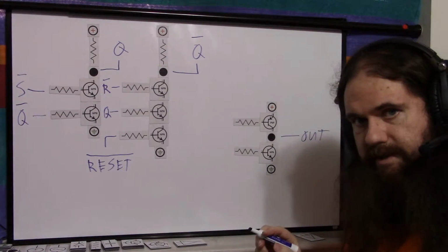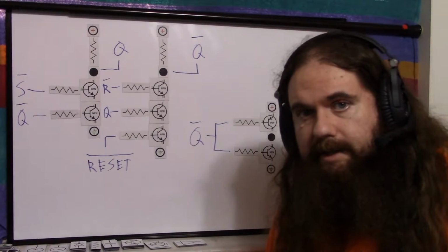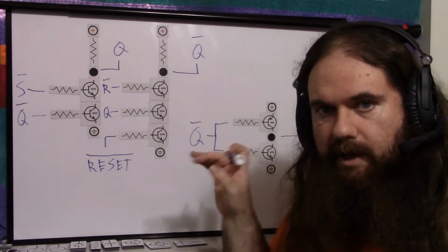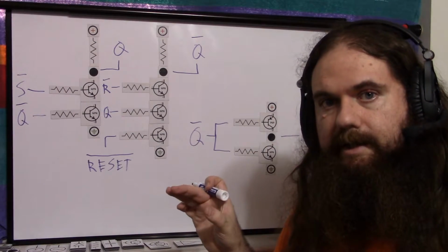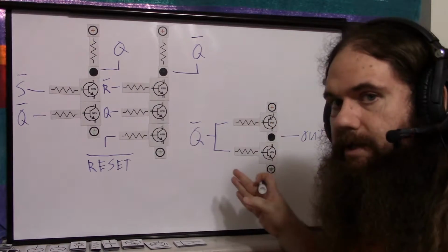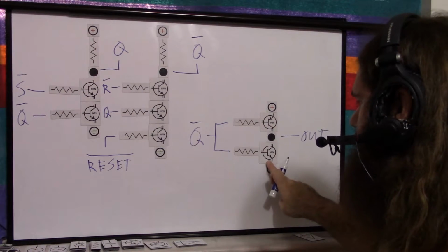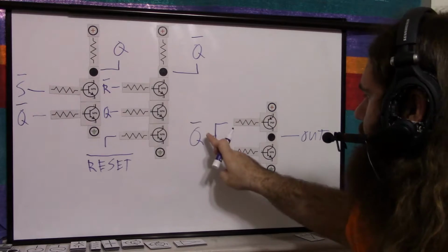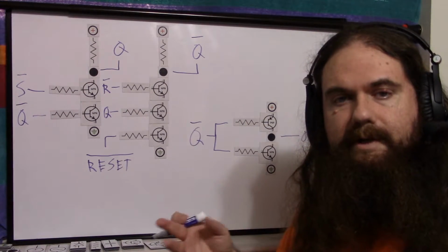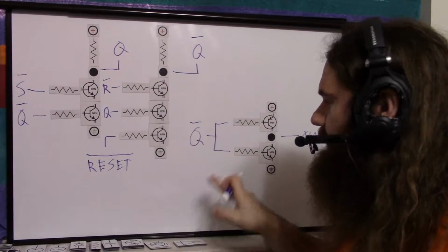Your output is the collectors. Q0 goes to both of these. And it's super elegant once again because we're using Q0 and we were able to drive the discharge output directly with Q0, and we can drive this with Q0 as well because this is naturally inverting. Because a high signal is going to turn on the NPN, which connects to low, and a low signal is going to turn on the PNP, which connects to high, so it inverts. So it's perfect. We don't need any other shenanigans. We accidentally had the perfect setup, and there's your push-pull.